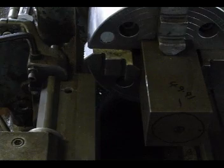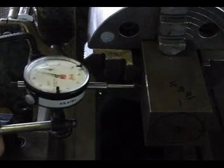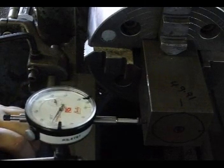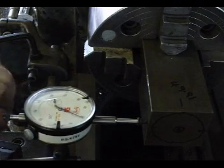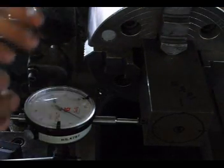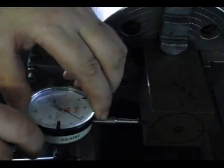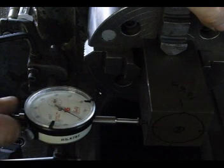Okay, just in case anyone wondered what I was on about when I was speaking about gauge travel, here's a 1-inch gauge. Now, a 1-inch gauge is going to clear, so if I stick a 1-inch gauge there, this is the way I usually use the gauge on this side, so I automatically move the metal in the right direction. So I've actually got a reading, you can't see this I know, I'm reading 0, and this is in thousandths of an inch.